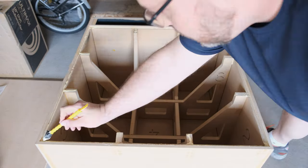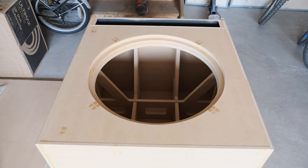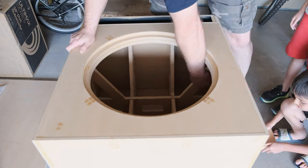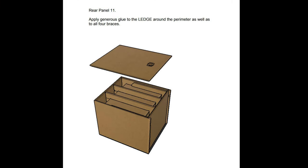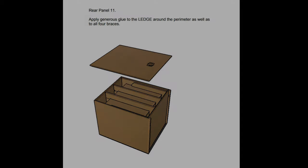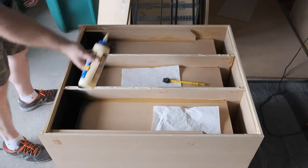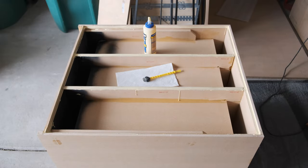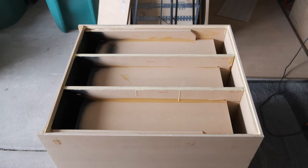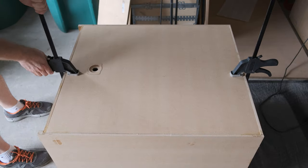This step is one that people find a little tricky. When you lay that top front panel — not the front baffle, but the piece the baffle will attach to — people find it lifts up in spots. That's because the internal braces didn't get pushed down far enough. If it's not smooth and flush around all the edges, pull it back up and use a chisel or sander to take those internal pieces down just a half millimeter or whatever it takes to get that piece to sit flat.